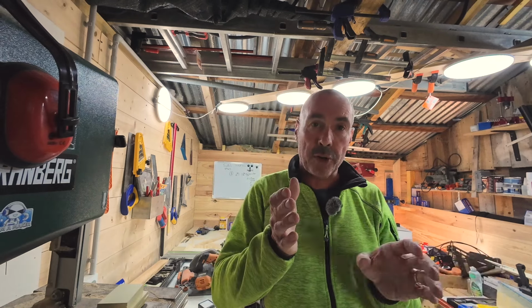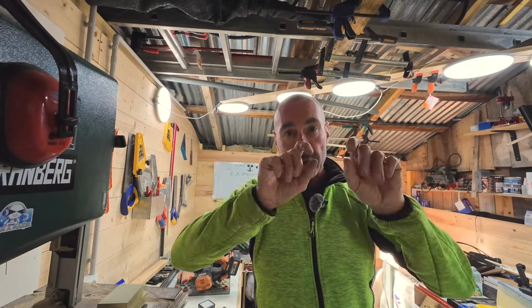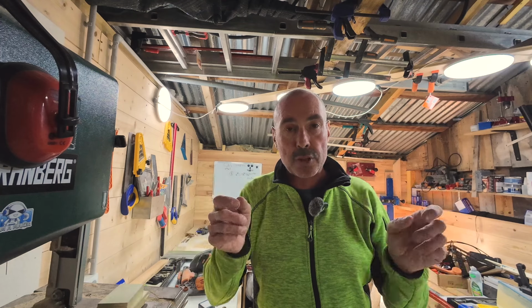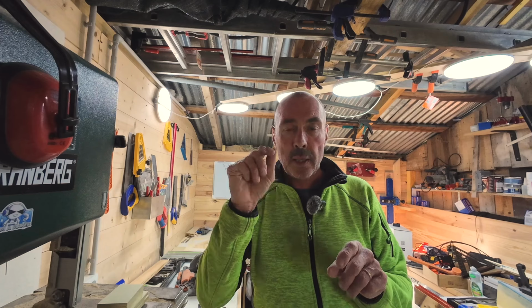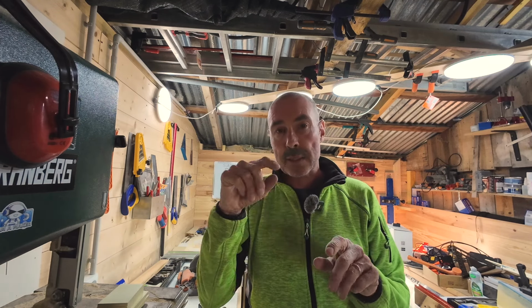With the end in the corner up against the end wall, I need to just space the unit out slightly so it gives a little room for the lid to overhang the carcass and move up and down. So I'm just going to cut a couple of pieces of the same stuff, maybe about 1.5 to 2 inch wide, and then just miter one end and fix it to the side panel, and then it acts as a little scribing point to fix to the wall.